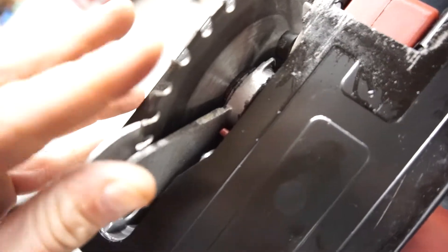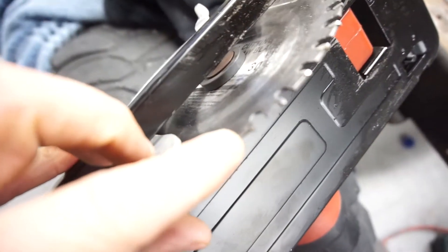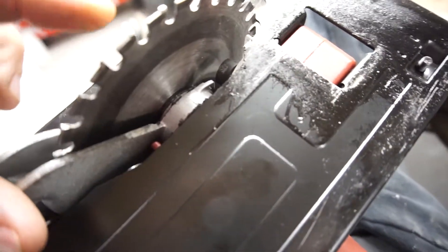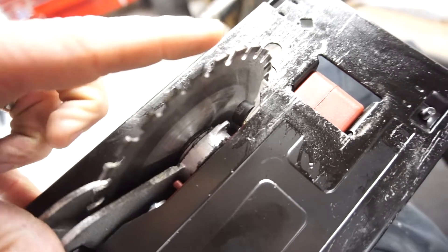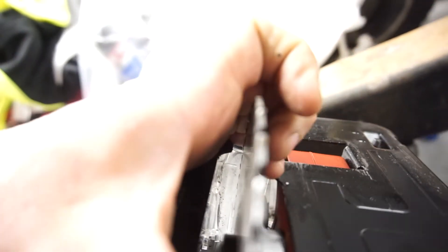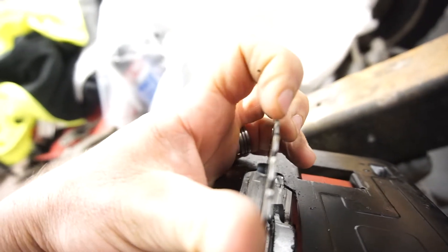It could be the design of the blade. The carbides are tapered on alternating teeth — one is straight, the next is tapered one way, the next is straight, and the next has a taper going the other way. So it's an alternating taper grind. You can probably see how one tapers that way if you look closely.